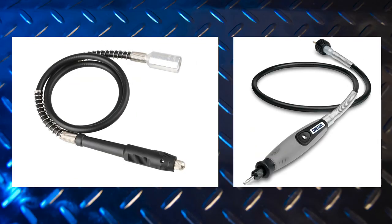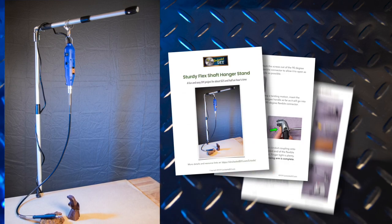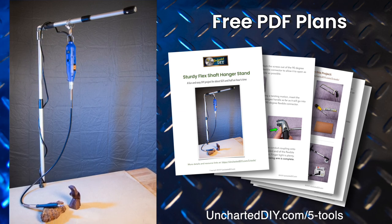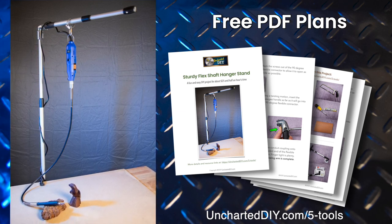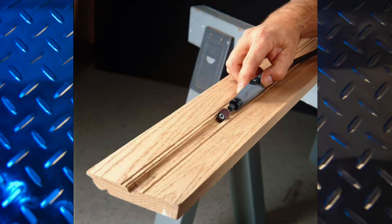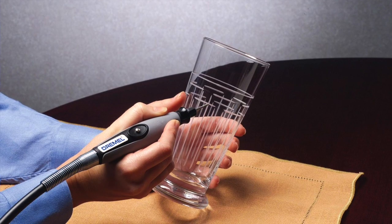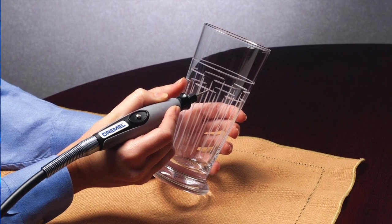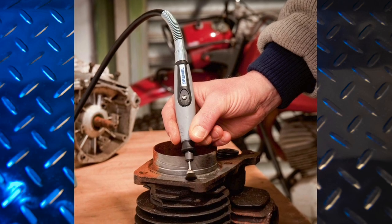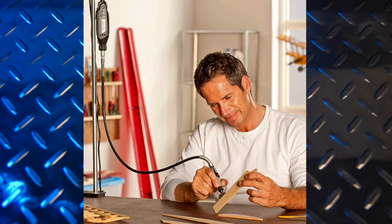These screw on and off the end of the tool as needed. It works best to have these suspended over the work area, and I have free PDF plans on my website showing how to build a super strong, versatile hanger stand like this one. These tools use speed rather than torque to do the work, so it's best if the flex shaft isn't bent too much. The speeds ranging from 3,000 to around 30,000 RPM can create a lot of friction and heat. You could put the tool on the bench while using the flex shaft, but it'll want to roll around. A simple fix is a hanger stand that puts the tool above the work area.